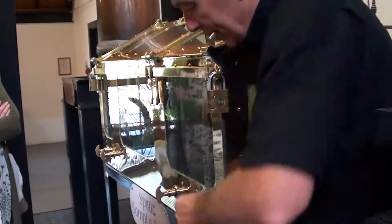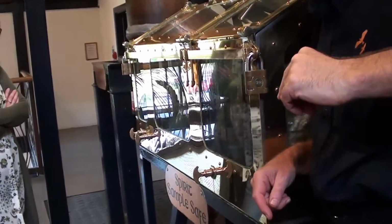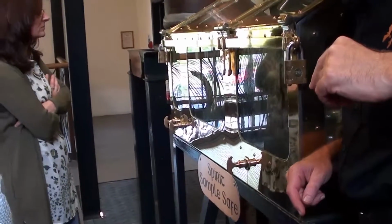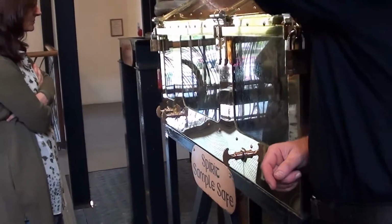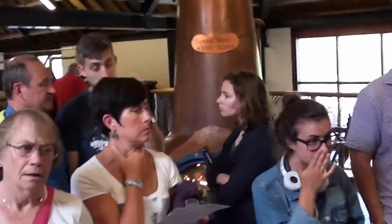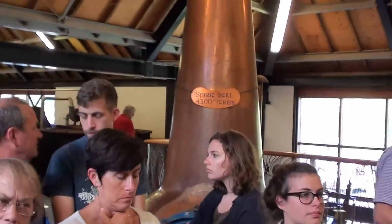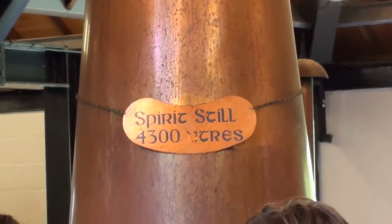It's called low wine. Goes down the pipe, under the floor, into another storage tank down by the window. Low wine. Yeah. We take that straight back out of that tank and put it in the spirit still for its second distillation. Most Scotch whisky is double distilled, but this time we're starting with that stronger spirit rather than this weaker beer. So just the same process.